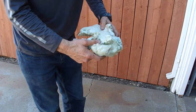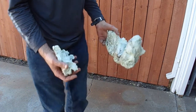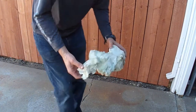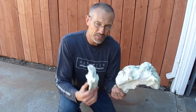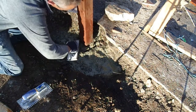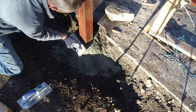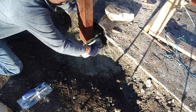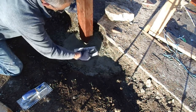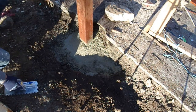I did end up pouring concrete on top of the foam because I wanted to have that angled finish — the concrete angled down so water would drain away from it — and I also wanted it to look like a normal fence post, not just white foam. You could just cover it with dirt, but I don't think that looks as good. I just dumped part of a bag of dry concrete all around the hole, poured water on it with a hose, mixed it up a little, and then used a trowel to form the concrete around the post at a slight angle so when it rains, the water drains away. It makes it look much nicer, like a real fence post.